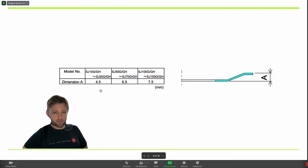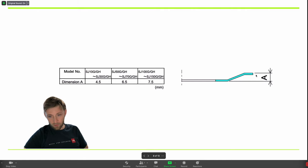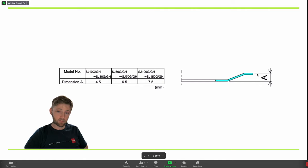The measurement of the flat spring itself also varies because the size changes and spare parts also increase in size. Be careful about where the measurement lines start — the measurement is from the top of the metal to the bottom of the metal piece of the flat spring — so you do not make any wrong measurements.